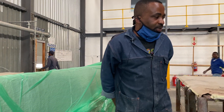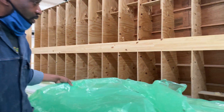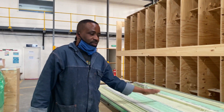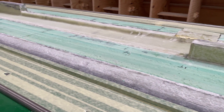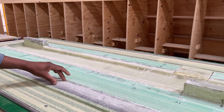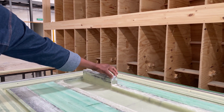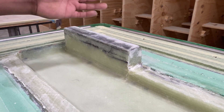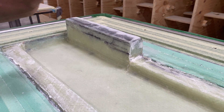The other part of the Daggerboard is on here. I fold it and close it up to avoid dust or contamination of the foam and the laminating. As you can see, we've got a monolithic trailing edge of the Daggerboard — that is only E-glass — and the E-glass solid block. That's where the sheaves will go. Once the Daggerboard is constructed, we'll use the router on there to fit the sheave — that's it — for the up-haul sheave.